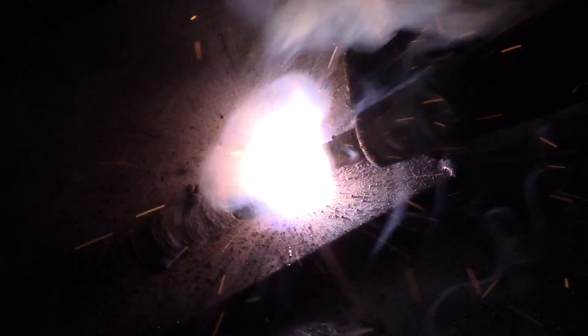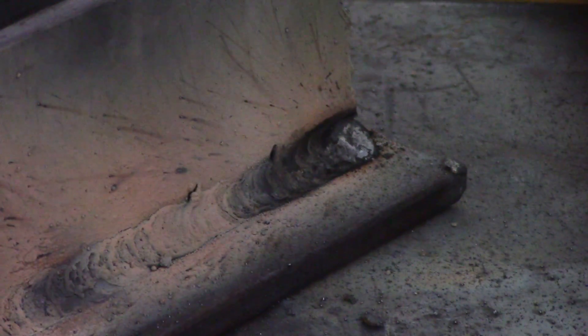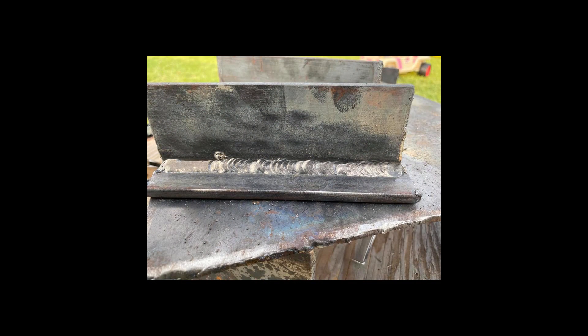Here's just a straight drag again — and then the breaker went one last time, so I went to fix that. When it came back I finished off this weld with a whip back-and-forth motion. This is on quarter-inch steel, which is probably the thickest metal this machine can handle. Then the breaker went one more time, but I was done anyway.